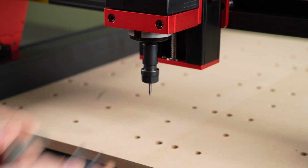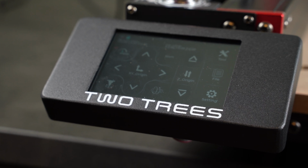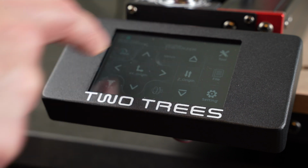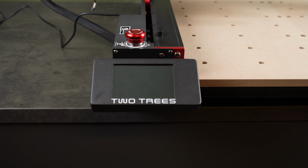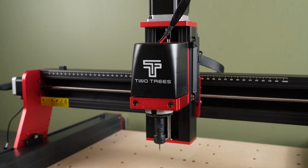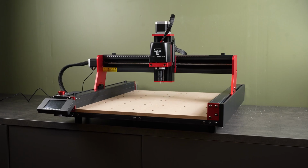Before you can make a G-code file from your JPEG design, you need to convert the raster JPEG into a vector SVG file. I did some research and the best way seems to be using a professional software like Illustrator, but that seems very expensive and complicated. The only similar software I have is Photoshop, but it doesn't really perform that sort of task. Luckily, I found a trick that will let you do it in Photoshop. Let me show you step by step using my logo as an example.